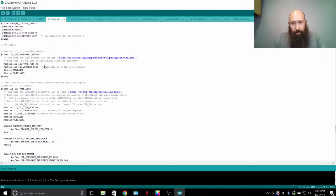Now, the 2004 LCD is essentially 4 lines by 20 digits of LCD, and there's that many digits on that display. Now, the full graphics is, I think, 64 pixels by 128. I forget how many it is. But that's what it stands for, the pixel amount, and that's essentially the pixel screen that you have to work with to make graphics, or a digit, or something like that.